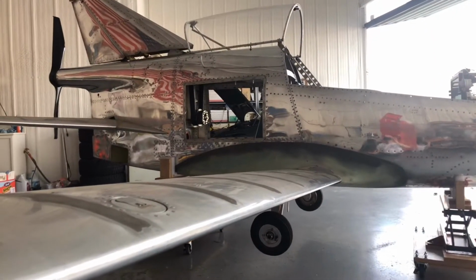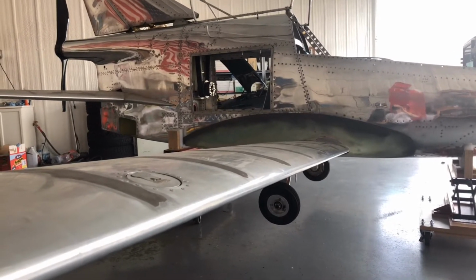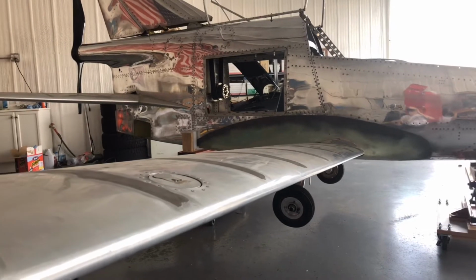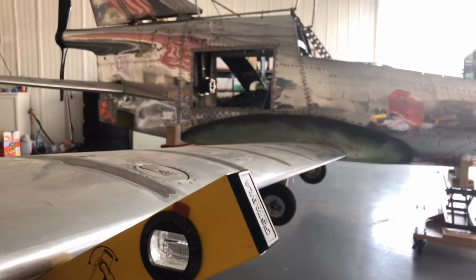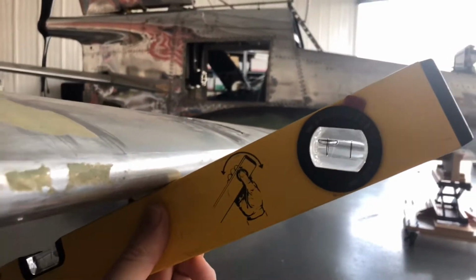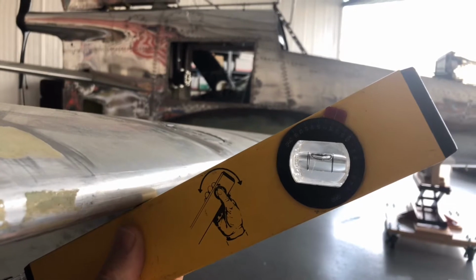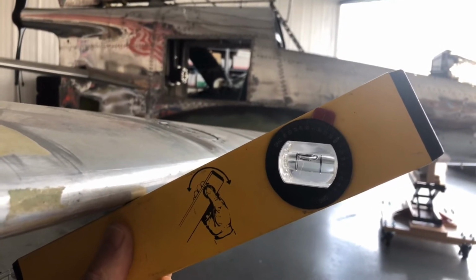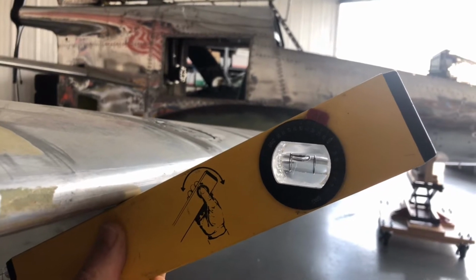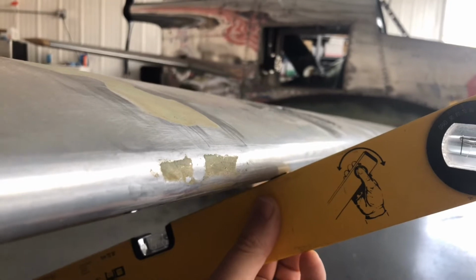So what I've done is made sure I've leveled the aircraft with a water line, and then side as well as laterally made sure that I am completely level. And then how this angle of attack sensor has to work is I need to be at 60 degrees pointing down, which basically ends up being coming back 30 degrees from the horizontal, and mark that area on the wing.